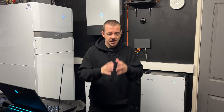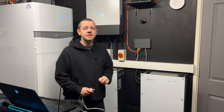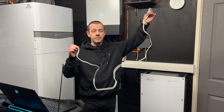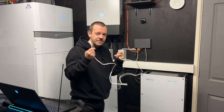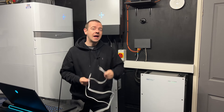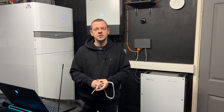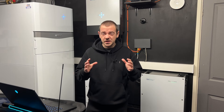I'm going to give you a few tips on connectivity for GivEnergy and other smart systems. The first thing worth doing if possible — either by your installer or by you — is running a cable from your inverter to your router. A physical cable will always trump Wi-Fi: it's stable, faster, always on, and no passwords are needed.